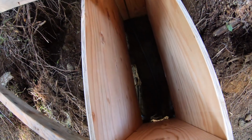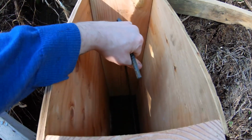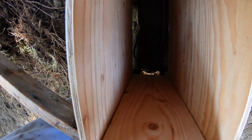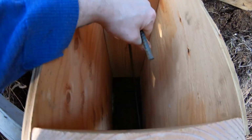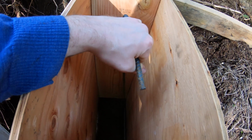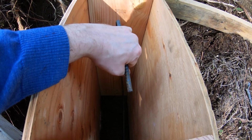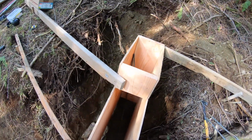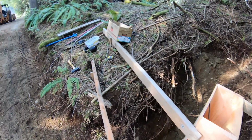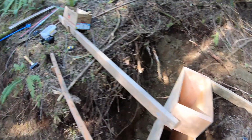I just took that one long piece and just bent it all around. You can see that I made a hook on the bottom. And I'm thinking that this is just the right length. A few inches of concrete on the bottom. And I can pull this up and just kind of rod it, make sure it's sitting up off the bottom. And slide this right through the bottom of the other hold down. Speaking of those post hold downs, I should grab them.